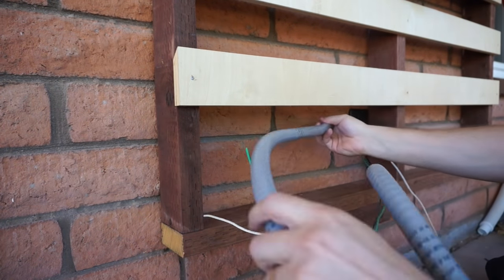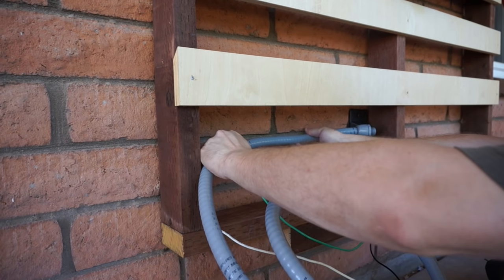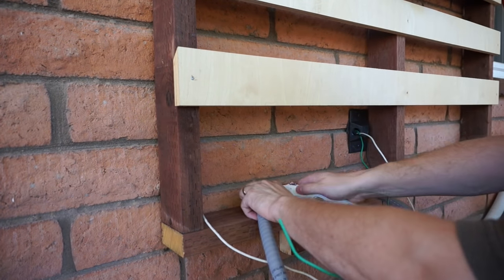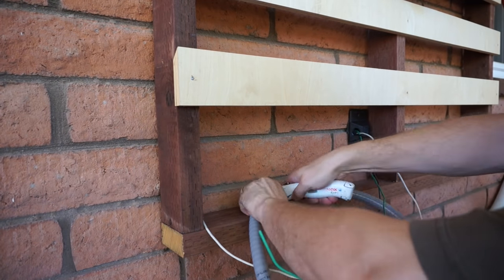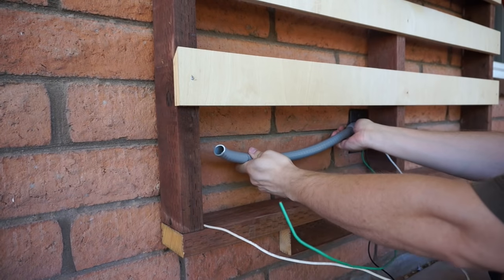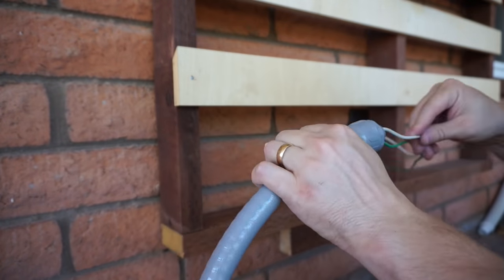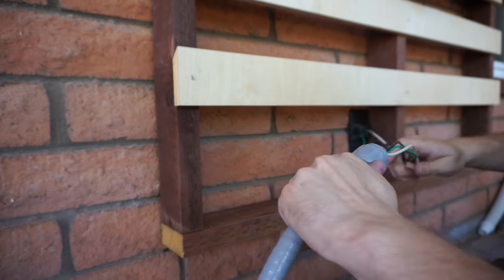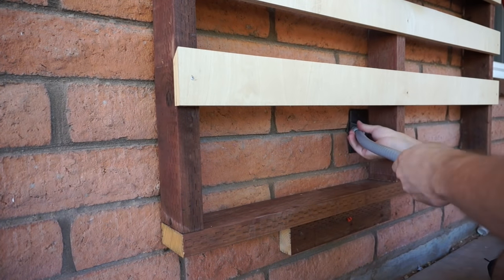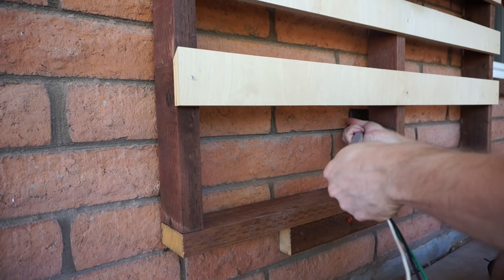Next step was I started to actually put the wiring in, but I actually want to cut it first. This is another thing where liquid conduit is a lot easier to use than EMT or PVC — you don't need any special tools to cut it, even just a regular utility knife cuts it very easily. So I threaded it through and screwed it in.